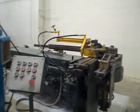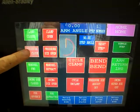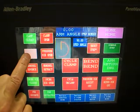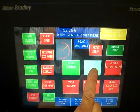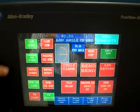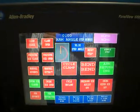If you want a close up on the clock, I'll do one more. I'm going to put the mandrel on right away, clamp it, pressure die clamp, mandrel advance - now watch the clock. I'll hold it on there. I'm going to bend and you'll see it go to 90. It's kind of nice just to see where you're at on the arm - that all works. They put that in as an added feature. You can watch when I return, it'll come back out of there again. Cycle unclamp and watch the return. There she is - just a feature, it's kind of nice. Thank you very much, let's call it a wrap. Shut her down.